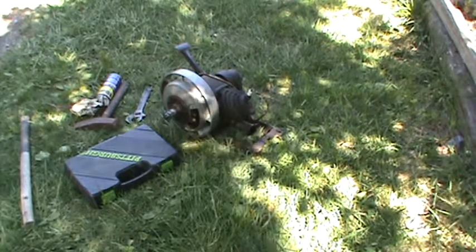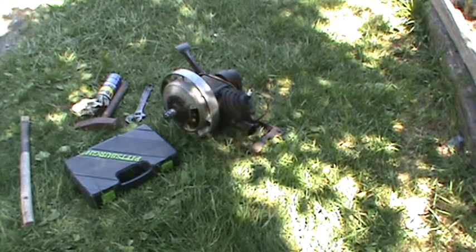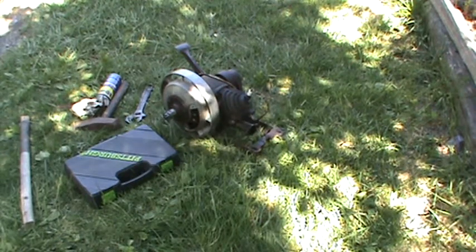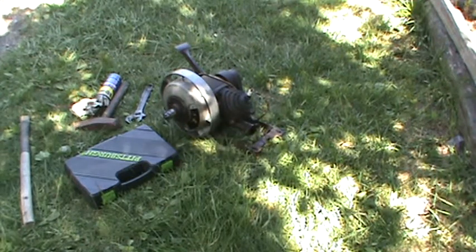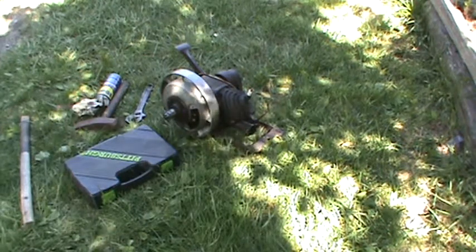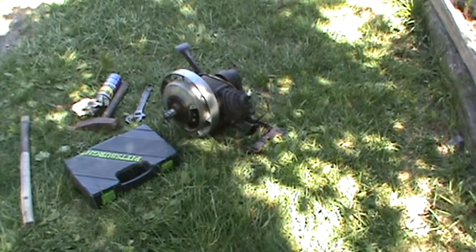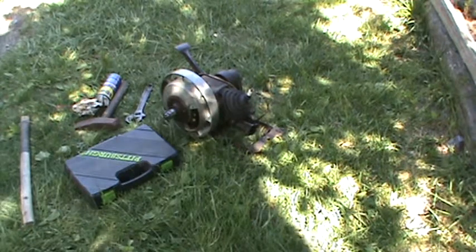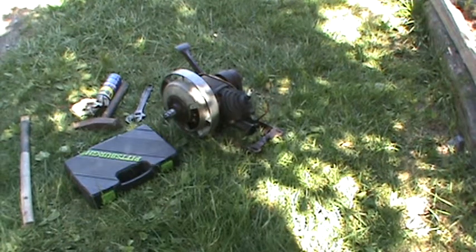One place I worked, we had big standby generators that were propane powered, that sat on little concrete pads outside in shelters. The starters were burned out in them — you had to take the flywheel off to replace the starter. I had a one-foot-long 4x4 that I just would tap around on there. Other guys over there were using pullers and pounding on them with hammers. The boss caught me doing that one day and asked how come nobody else does this. He conned me into showing other guys how to do it.